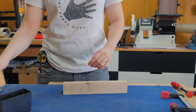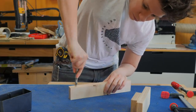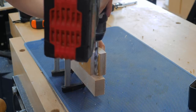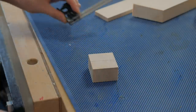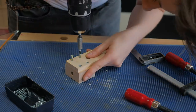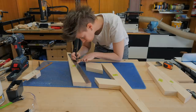To join the parts together we will be using dowels and we better make a quick and simple jig. You just need some scraps of wood — if you use hardwood it will work best. Attach two scrap pieces together that have a perfect 90-degree angle on one side. Get a wood drill bit that has the same diameter as your dowels and drill a hole into the hardwood scrap, keeping the bit flush against that reference corner.